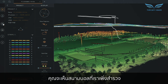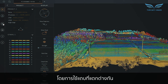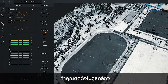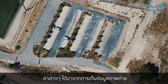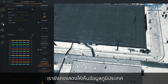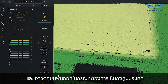You can see the sport field that we just surveyed. You can also colorize by echo number, by strip, by different strips that have been used, and also by the intensity value of the LiDAR. If you have the camera module and the color module for the Cloud Station, you can colorize the point cloud by RGB values coming from images collected at the same time as the LiDAR flights. We also propose a terrain module that allows you to classify between ground and above-ground and remove any above-ground objects in order to reveal the terrain model.